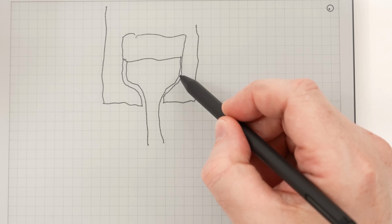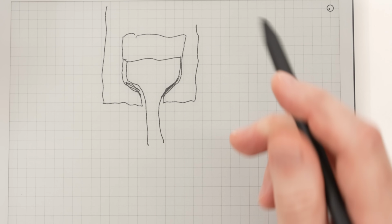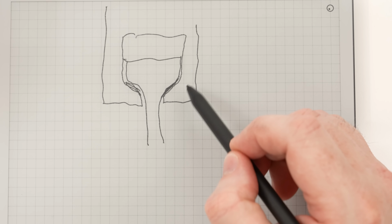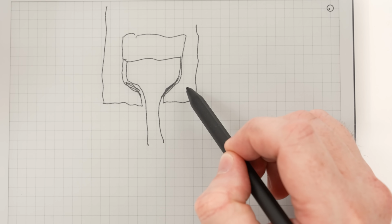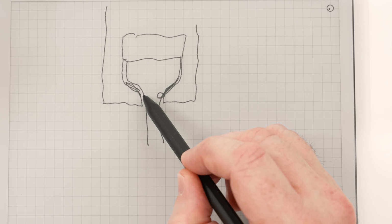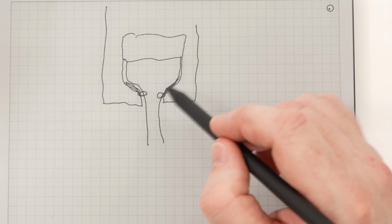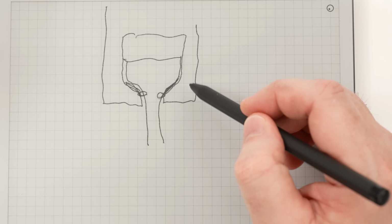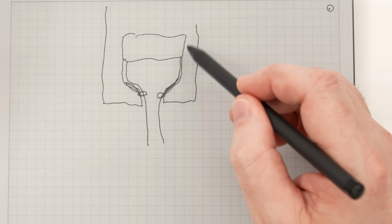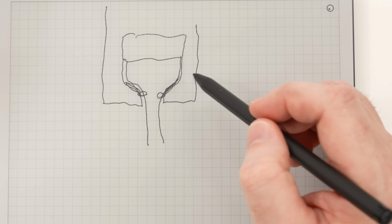The idea being that then you're spreading that load across this entire surface, and it's not all focused on one point. Now, if this were perfectly rigid, like if this were metal, then I think as this starts to pull, the stress would build up in these two places. But I think as long as this is flexible, because I'm gonna print it from carbon fiber nylon, it'll actually conform to this. I'll make the sample fit that as closely as I possibly can.